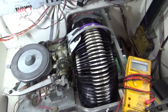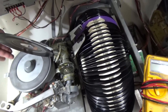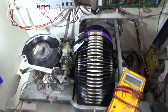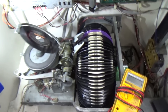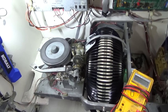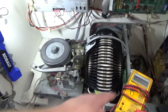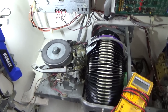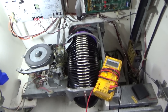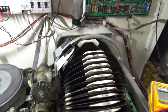It's trying to play another one. See how it's not doing anything now? Well, if you mess with this relay — big ice cube relay — it kind of goes through the motions. I think we've got amp problems. I don't like how it's not stopping where it's supposed to stop again. I've got to reset all of the credits and then go from there. I hit the button that clears the selections and it went back to home and stopped.